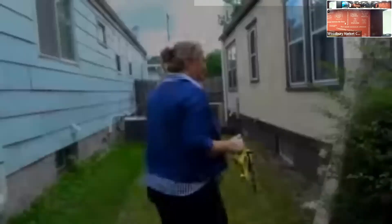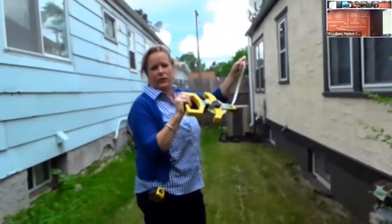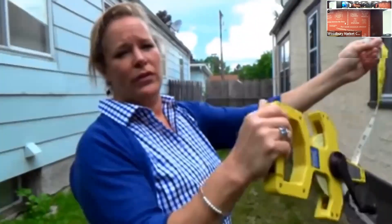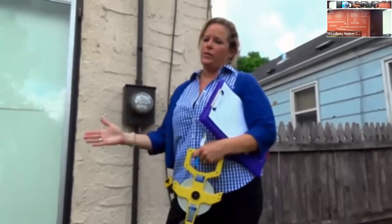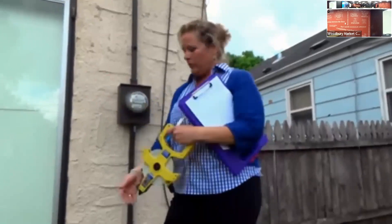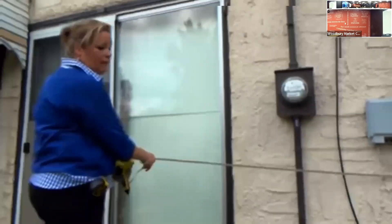Sometimes you just have to start from the opposite end. As I walk along, I pull up and look down to see what the basement is doing and what upstairs is doing. I can pull behind the decorative area and know that's 30 feet right there. I'm at the back of the house. You might think — you already measured the front, why measure the back? It might have jut-outs. It's also a way of double-checking. I always do all four sides to make sure the front matches the back and the left side matches the right side. So you catch any mistakes.